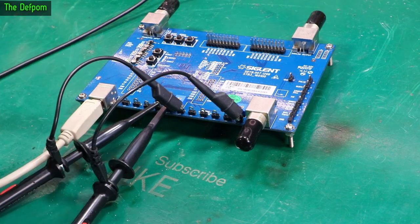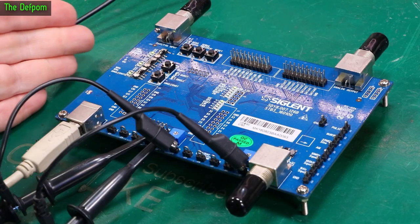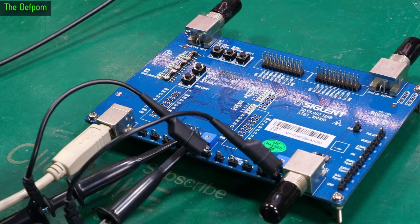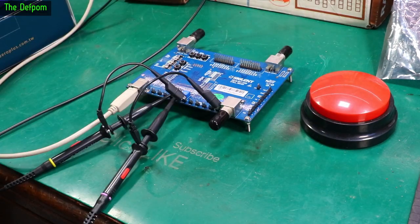So if you've got a pin header version, the data you're getting out isn't going to be the full signal — it's going to show 'NT,' missing the first five characters. The manual states there's a 7 and 10-bit addressing mode and it outputs 12 bytes of data. I'm wondering if these very early boards have a mistake where the data coming out is not 12 bytes but 7 bytes, because the difference between 7 and 12 is 5 — and we're seeing a reduction of exactly 5 bytes. This board outputs 12 bytes; the early ones appear to only output 7.